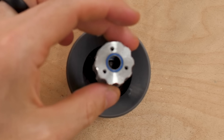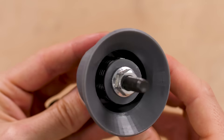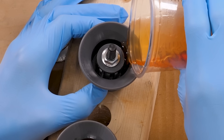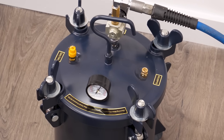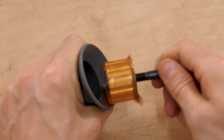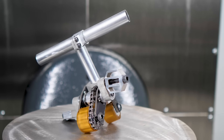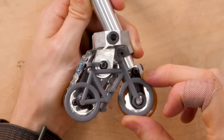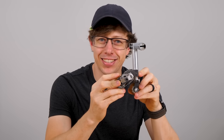The last thing we need is some tires, so we're going to cast some wheels. I made a 3D printed mold that fits around my wheels. We're using a two-part polyurethane to get a nice hard rubber — it's a pretty cool process that works surprisingly well. It kind of looks like a giraffe, and even though it looks huge it has the same footprint as my prototype. I love it — it's so tiny.